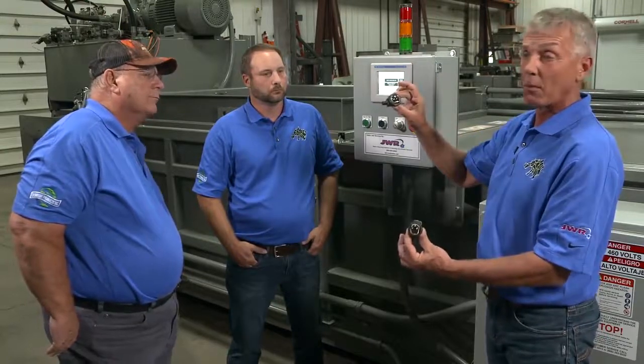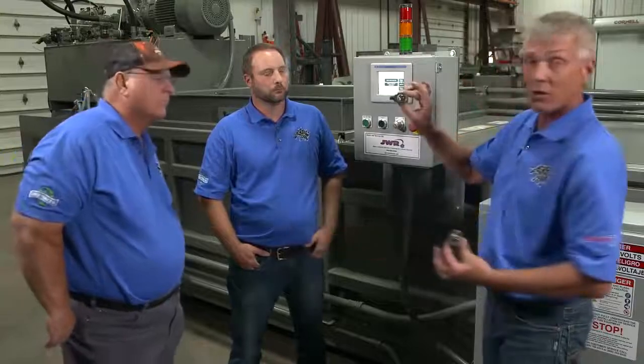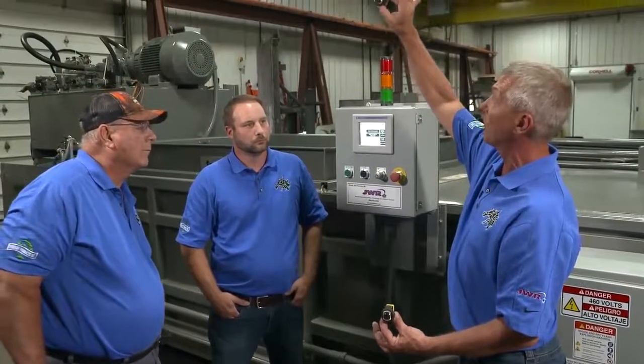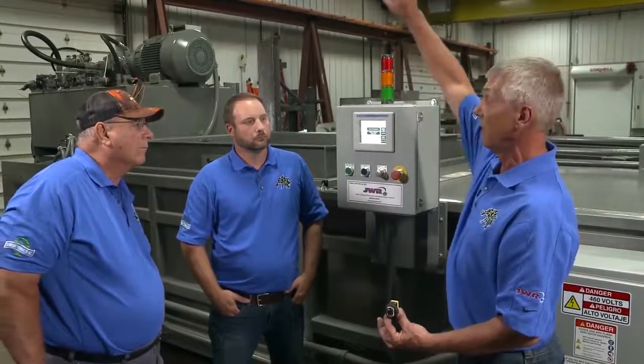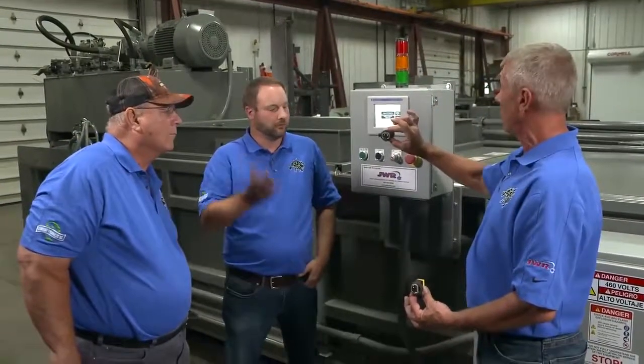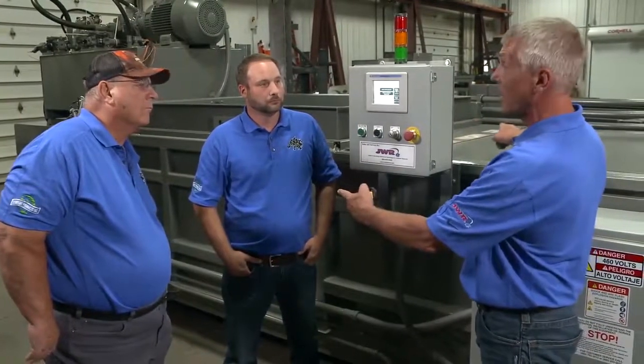You may want to start your gathering ram a little sooner or a little later — this one actually is on a track and runs laterally. In most typical setups with an extension hopper and a conveyor, we mount the upper one high but also give it a range so it can travel instead of having a fixed location. We also give front-to-back positioning on our lower eye as well.